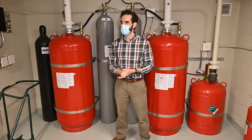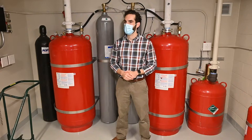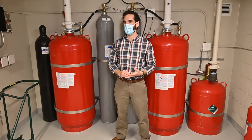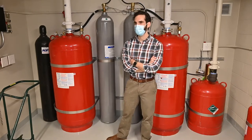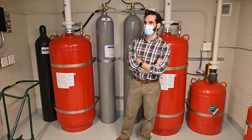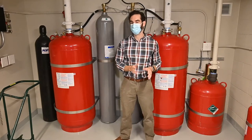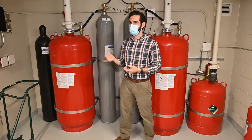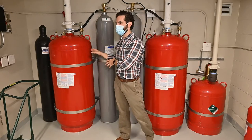Is there a scenario where dust alone sets off the clean agent and discharges? If there's enough dust — whatever would set off a smoke detector could set this off. It would have to be 3.2% obscuration per foot, meaning that visibility for 100 feet would have to be 3 feet less. The whole point of this is that it's two different smoke detector systems — your smoke detector network is one system and VESDA is another. You can short one out by accident and it won't set the system off. You have to have your VESDA system detect AND your smoke detector system detect — two separate systems.